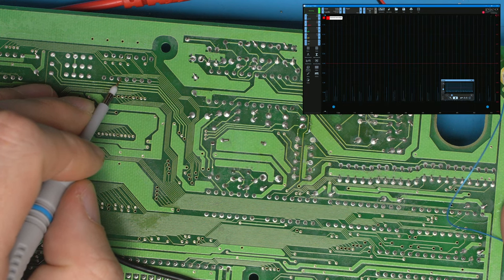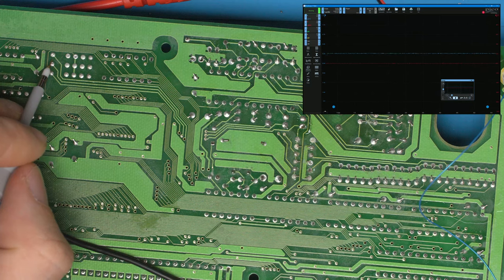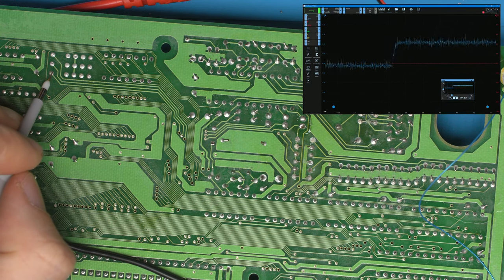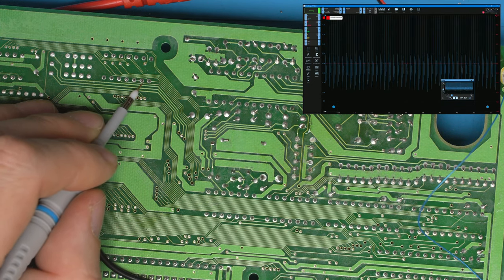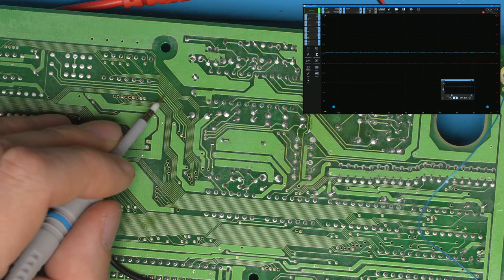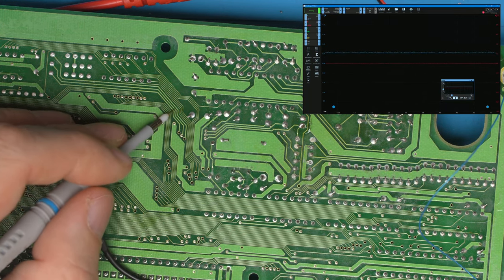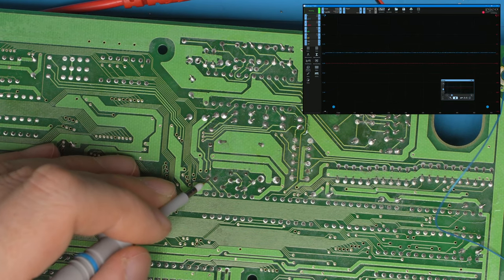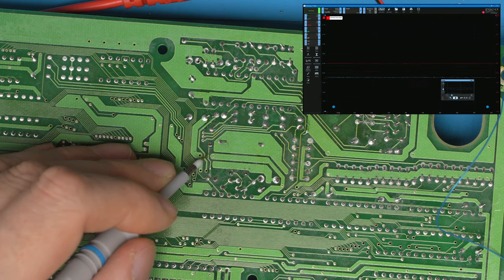Yeah, that's not a good sign. So it's actually probably easier to redirect these three wires completely from where they're going, because these three all pass through a clock, a clock, a clock, a clock, a clock. There's now five pins of clocks running here, which are causing induced voltage, basically crosstalk between these traces. So I think what we can do is reinstate this one, I guess, because we're not concerned.